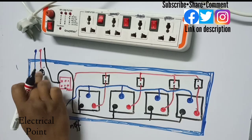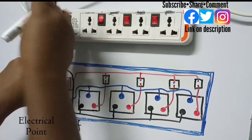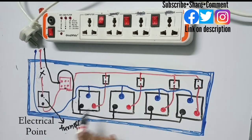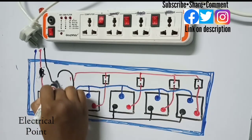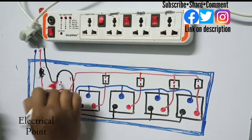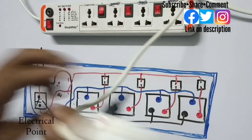If the fuse wire is opened, the phase will break at that point, so there will be no supply to the board and it will not work. Similarly, if you turn off the main switch, the phase wire breaks and the LED lights will also not glow. If you don't want to use the LED lights, you directly connect the neutral wire to the plug points and the phase wire goes directly to the switches, simply skipping the LED.